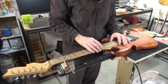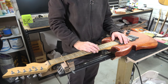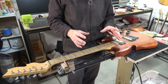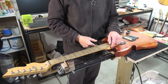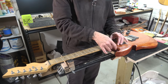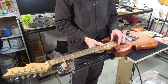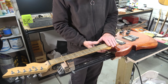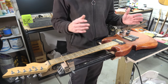The next issue was routing the depth of my neck pocket — I wasn't sure what depth to route it to. Since I was using a Fender Stratocaster-style neck, I measured the pocket depth on one of my own Stratocasters, including the thickness of the pickguard, and made my pocket that depth. As it turned out, this neck isn't exactly the same size as a licensed Fender Strat neck. When I inserted it, the neck sat too deep in the body, and I didn't realize that until after I strung up the guitar and couldn't get the action where I wanted it.